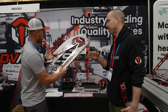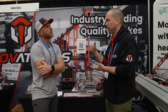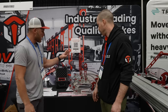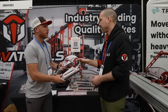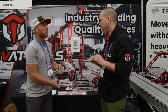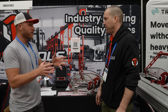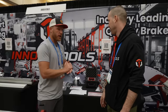We have a heavy-duty model that does light gauge steel up to 24 gauge. People love it because a lot of times they buy stock that's 48 inches wide, so being able to fit 24 inches in allows you to rip the sheet right down the middle. We use quarter-inch laser-cut aluminum — no cast parts, everything is machined out of billet. We manufacture everything in-house in Ontario.